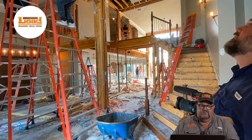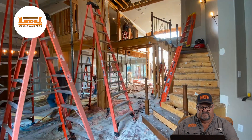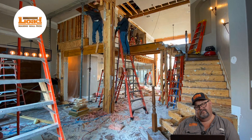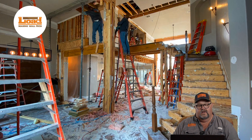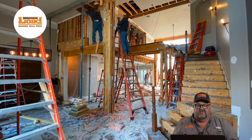Continuing with trimming and taking out the staircase. We can see we've taken all the trim off; now the handrails come off. Right here the guys are putting a beam on the back to open this wall up. This right here is a room and it's open to down below — they want that to give the room upstairs an open and airy feel. Then right here you can see we've cleaned this up and created the beam pocket. We have a 30-foot steel beam that's going to go in there and come all the way to the front to intersect right in here and carry the load of this existing wall.